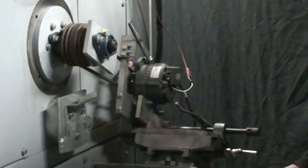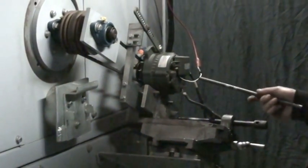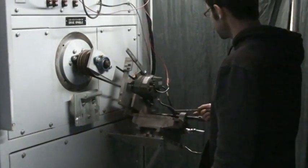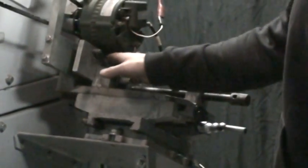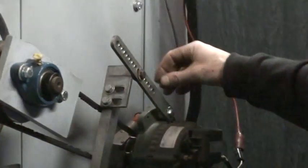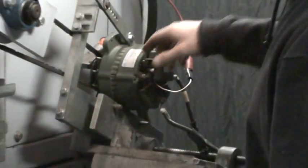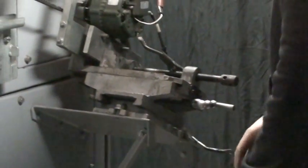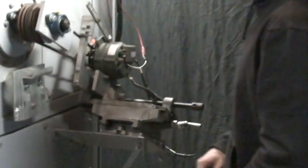Over on the alternator drive end, you can mount the alternator in two different manners. This is a belt driven alternator, so it's mounted in a vise and then driven off the spindle with the belt. This vise has adjustments in the X and Y direction and it's very easy to line up the pulleys. You clamp one side of the alternator with a pin — there are five different pin sizes for different size alternators — and the top is fixed with this variable hold bar. The speed is picked up off the pulley on the alternator with a light sensor on a gooseneck. You just put a white line on the pulley and it picks that speed up.